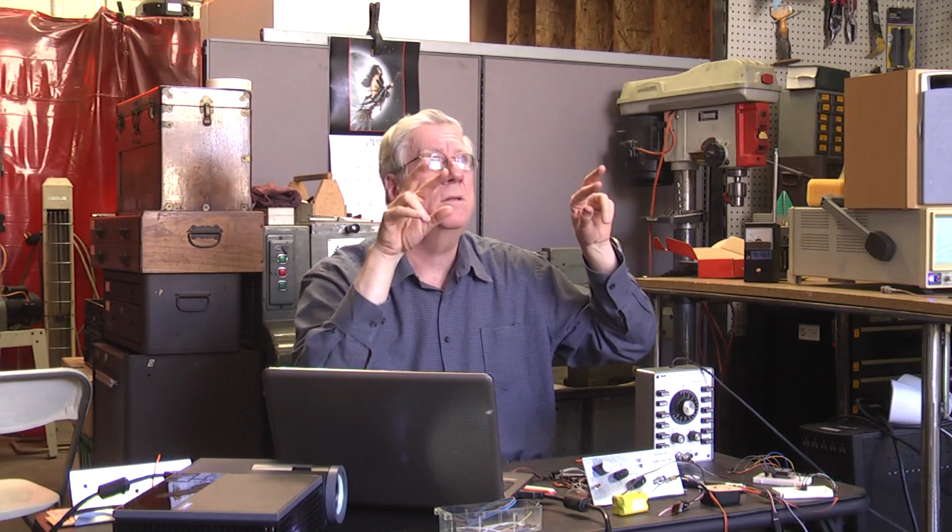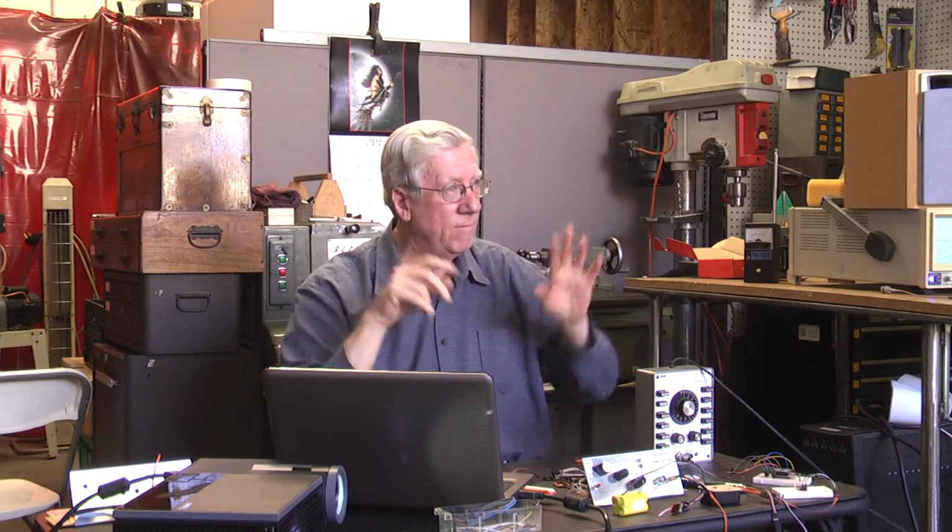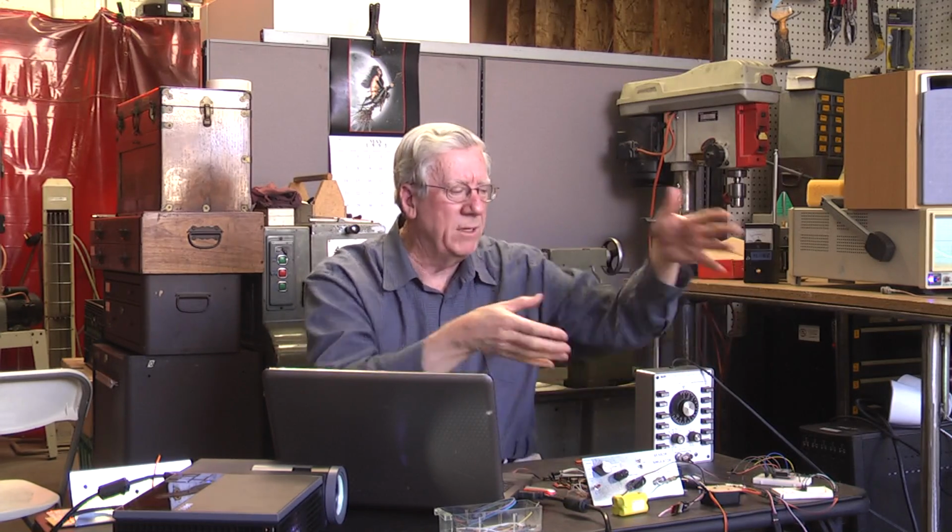You've referred to this as Wi-Fi. Is this the same 802.11 protocols that laptops use? As you may know, there are lots of IEEE 802 standards. This one is 802.15.4. And the class is low cost, low data rate. So it had in mind this application.